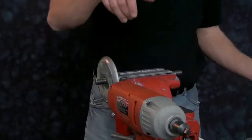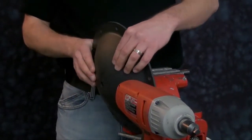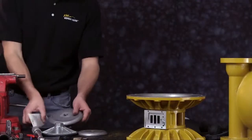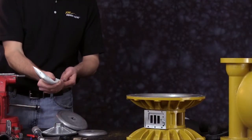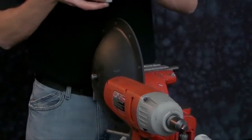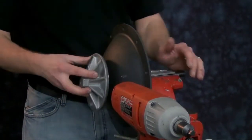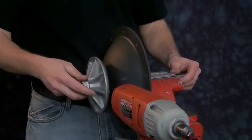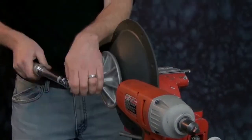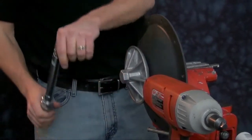Ensure that the radius of the inner plate is facing the diaphragm. Now install the diaphragm with the air side facing towards the inner plate — natural bulge out. Next, put a little grease on the outer diaphragm plate also to ensure that we don't get any false torque when it comes in contact with the rubber diaphragm. While any lubricant can be used, hydrocarbons should never be used when installing EPDM parts. Now we're ready to torque the diaphragm assembly to the torque specification listed in the service manual.